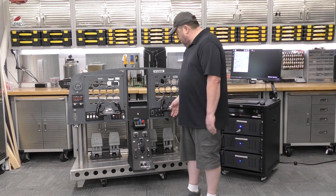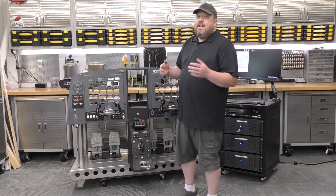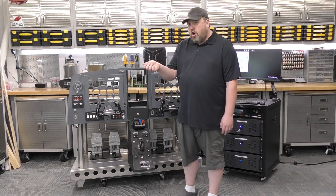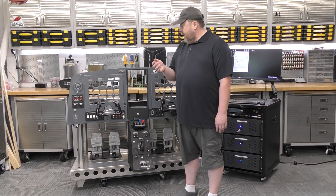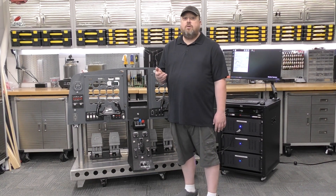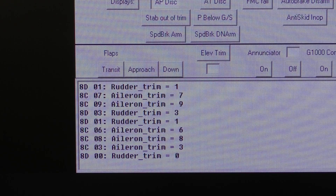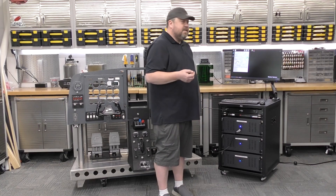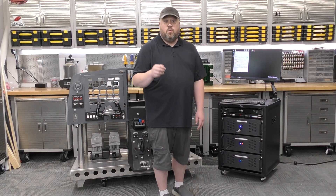There are a few other bugs. Our trim for ailerons and rudder are going to need potentiometer replacements. Old carbon swipe style — they've been used a bit and sat for a long time, and that just eats those potentiometers up. Replacing those will help clear up a problem we've had in the software, which is noise — lots and lots of data updates being sent to our test software from the controller board because of so much noise in the system with these old components.